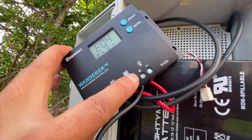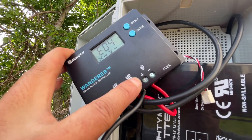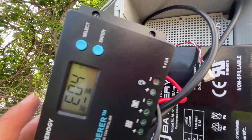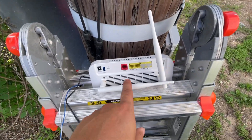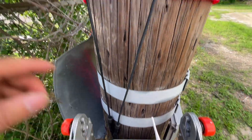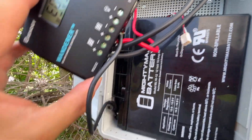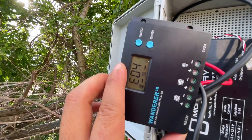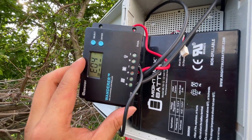I tried some fans like computer fans at 12 volts. My real purpose is to power a wireless router, which should be completely within its capability — it's only 2.5 amps and this controller is supposed to do 10 amps at 12 volts maximum.